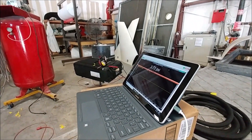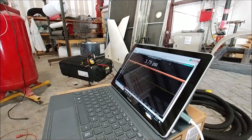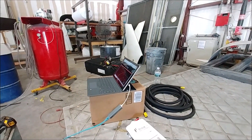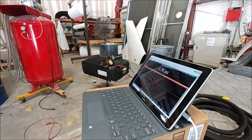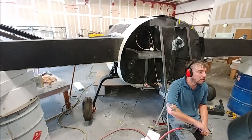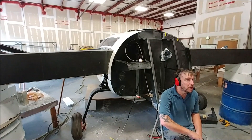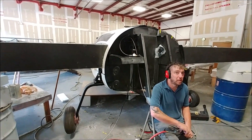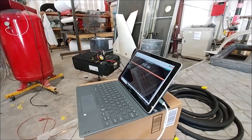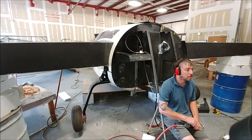Already at 3.73-3.74 and moving up. The target goal for the fuselage is to get to five and a half PSI, which will give us an 8,000-foot cabin at 25,000 feet. Mark had told us the fuselage could be expected to expand by as much as half an inch in length. The door frames are getting larger, the doors are probably expanding a little bit - everything's turning into a big balloon wanting to stretch out. That's why that door seal gave way in the first place - the gaps between the inner frame and outer frame were getting larger. Now we've crossed into 4 PSI territory with no sign of any leaks and no real creaking. Starting to feel pretty confident we've got this in the bag.